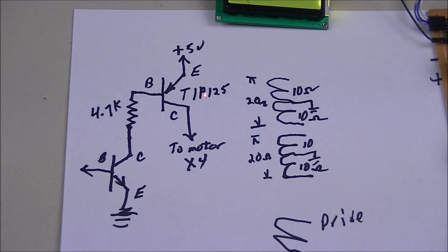Let's look closer at the driver circuit. That's a TIP-125 — it's actually a PNP Darlington. Those are what's on the heat sink on the other board. Here is the internal transistor in a ULN 2003 transistor array. The voltage from the control board goes in, switches on this transistor, and creates a current path through the emitter, through the base, through the 4.7K to ground — it switches the 5 volts down to the collector on the appropriate motor coil.